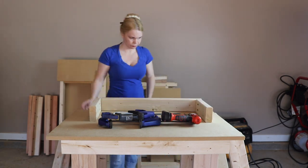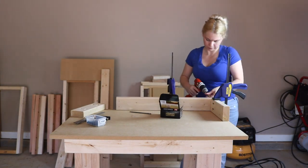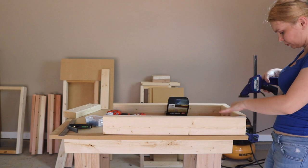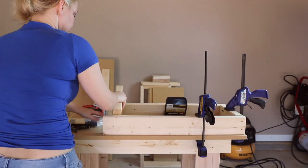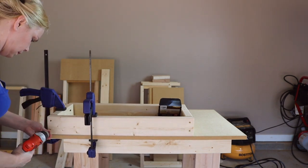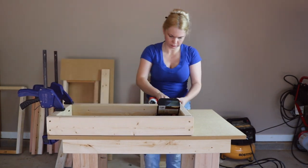On the bottom frame, I needed the final dimensions to be 6 by 6 inches smaller than the top frame I just built. I'm just doing a butt joint, but this time you can see that I drilled the pocket hole screws in the end sections — but I'm not using those, because I cannot get my drill inside the frame to do the pocket hole screws since it's slightly too small. So I'm just using plain old wood screws and inserting from the exterior. It's not going to matter much because that's not going to be seen anyway.